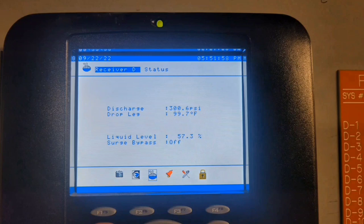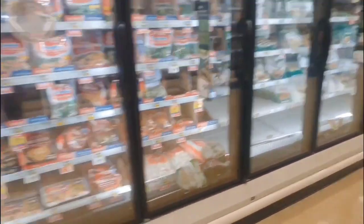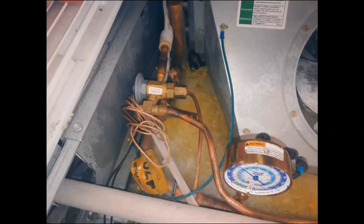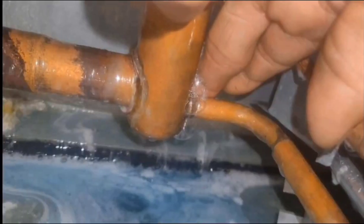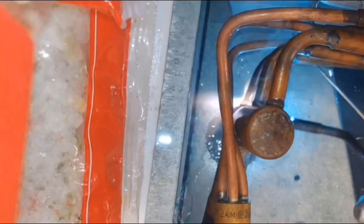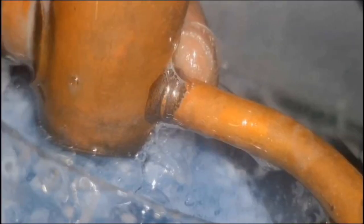That was with six jugs, with all circuits closed in defrost. When they all opened back up, the rack level was around 20. This is just a video clip from yesterday - I didn't get footage at the very end because my phone was dead. I made this repair on case D5, and today I went back and charged it up because they had a low liquid alarm. It took six jugs of refrigerant - 144 pounds - and it's back up and running now. Thanks for watching, I appreciate the support and comments. I'm glad the videos are helpful, so I'll keep making them.